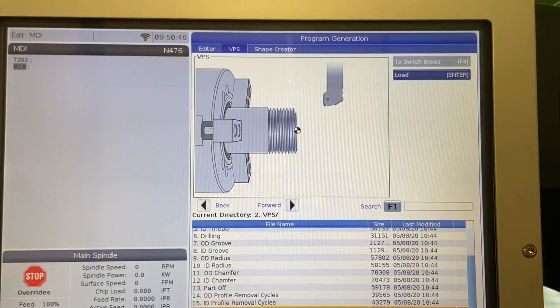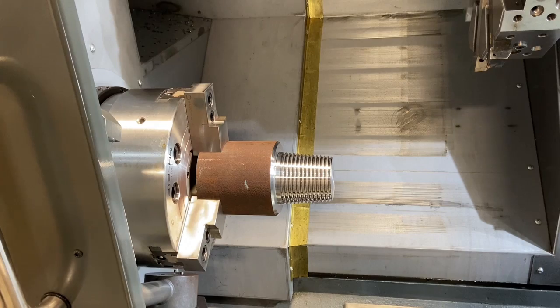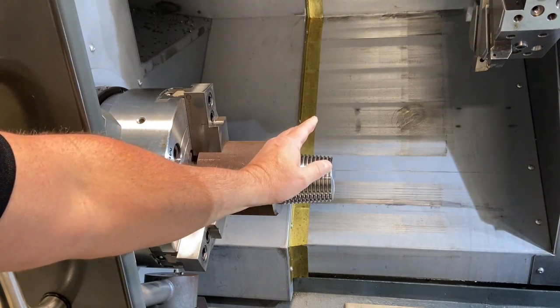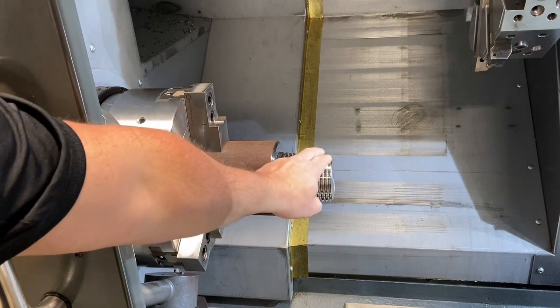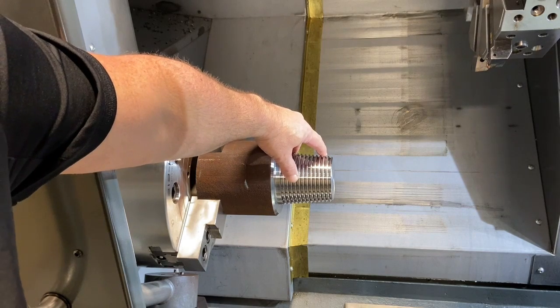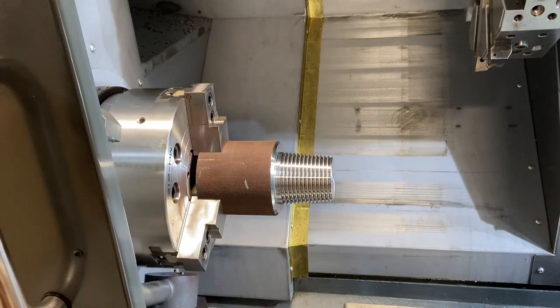Once I do that, I can go back to my program itself, go straight down to tool number two, and just run the threading cycle. What I just did is drop my tool into the second lead back and call that G54 Z zero. That would be the intention of doing what we call a pushback in the oil field industry — meaning we would face the part off shorter, push back the shoulder, and then re-thread the thread, making sure we got 100% cleanup all the way around. If you do not need to face off or push back the shoulder, after you teach that thread you will have to bring it two threads to the right. In the case of a quarter inch lead, we would bring it to the right by a half inch and teach that as our Z zero. You can do it automated in a G10 sequence or simply set the tool and then shift it half an inch to the right.